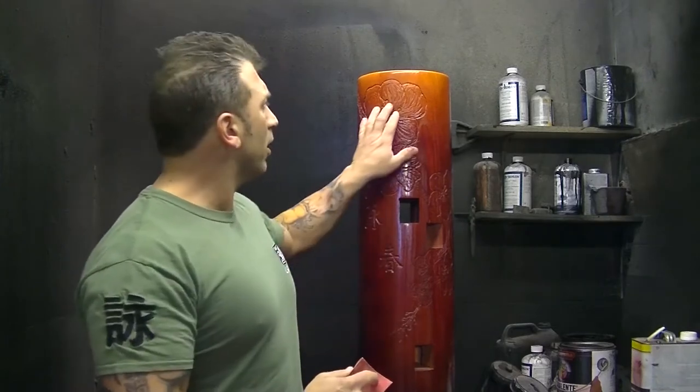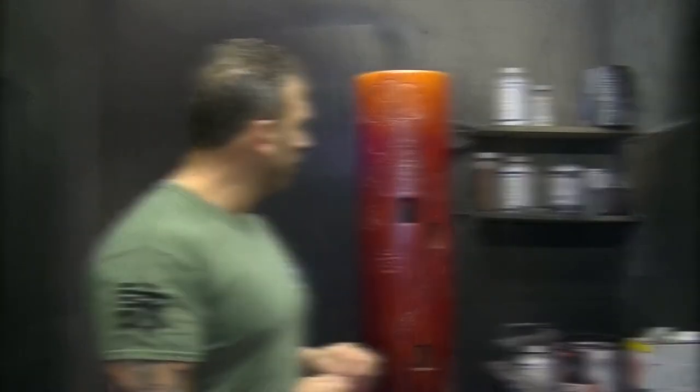Okay, we're back in the spray booth now and we're about to start the airbrushing. Before we do that we have to lightly sand the spots we're going to airbrush so we'll get a good adhesion to the existing finish. Once that's done we'll start laying in the base color. Then after the base color we'll go to the shadows, mid-tones, and then the fine detail and highlights.